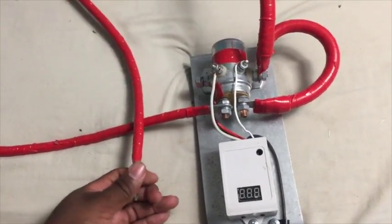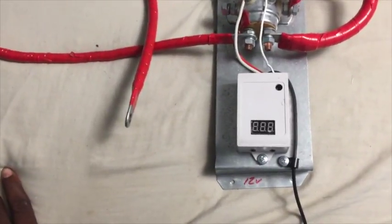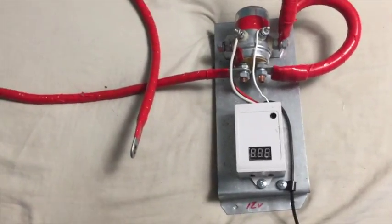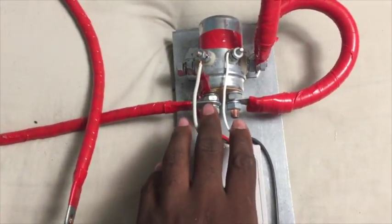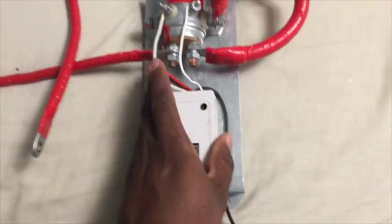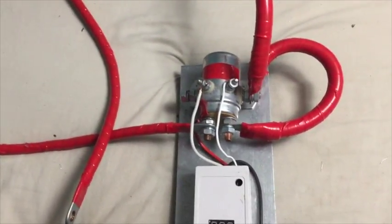I've programmed this to work for 48 volts and then changed it to work for 24 volts. As you can see, you have a solenoid — in its current configuration this is an always-closed position and this is an always-open position. You have the ability to program that using this unit by changing the letters from high to low, making it always open or always closed, and then these open at certain times.